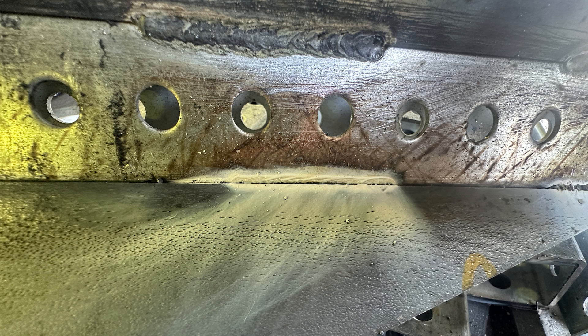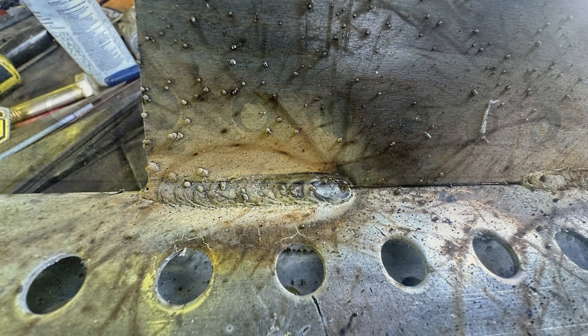Even the dust from grinding will get into your lungs and make you sick. Besides the color of the soot around the area you weld, if you TIG weld it you'll see a blue arc — it's probably the zinc reacting with the super high heat of the electric arc. You'll occasionally see a blue arc even with stick welding and flux core. Any indication of odd arc color is a great indication that you're welding on something coated and not good for you health-wise. I used Harbor Freight's flux core wire, which has a lot of spatter, but you can expect pretty poor welds when you don't grind off the zinc coating. This spatter cleaned off with a wire wheel on a grinder. You're going to get weld porosity — it's just unavoidable.